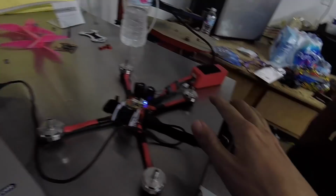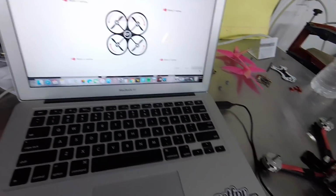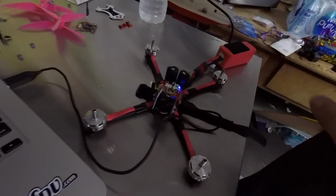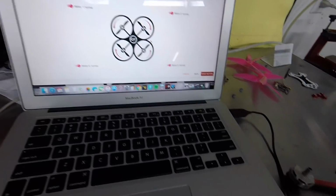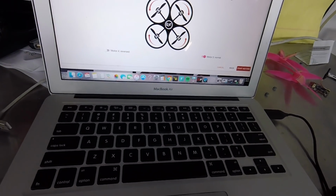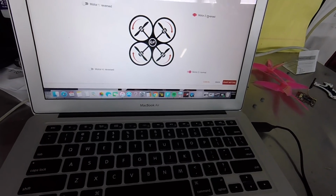And then it's not even going to do the fourth motor because it's got 3 of the 4 at that point. So you can literally solder motor 1 to anything on here, no matter what ESC it is, and it'll work. So wait till all the tones are finished. We knew that every motor was wrong except this back one right here, okay? So you're going to want to click every other one. Not that one. Not this one? You're right, that one.